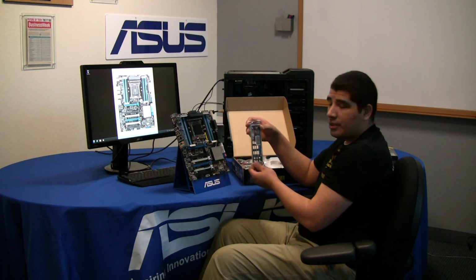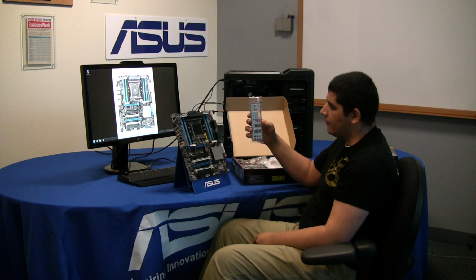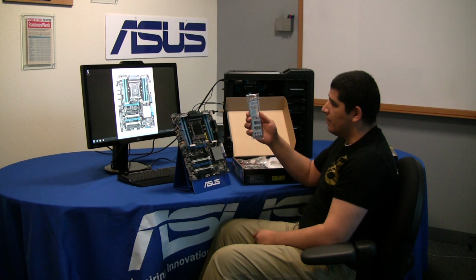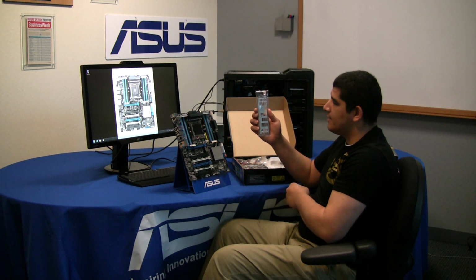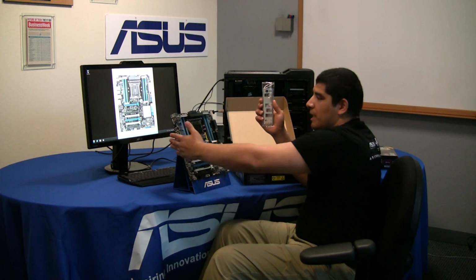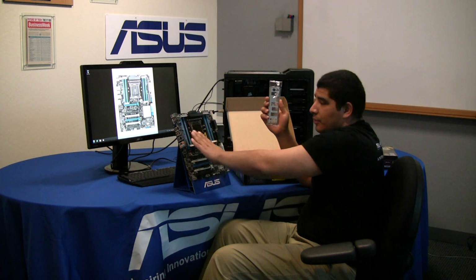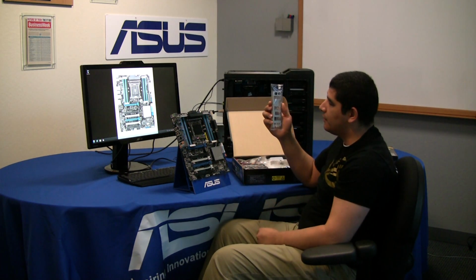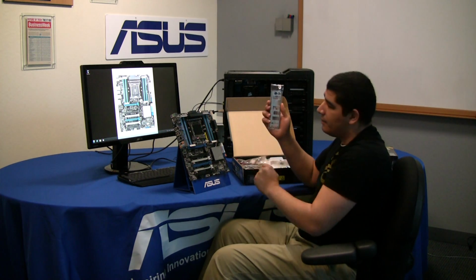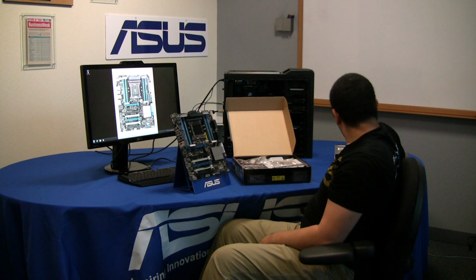We've got our Q shield. With our Q shield, like always, we have the soft padding to allow for a smoother, softer installation, but as well as this, Q shield offers enhanced protection against EMI, electromagnetic interference, because of course in our exposed backplane on our I/O, this area with more trace layout, not only for the 4 DIMM banks here, but also the I/O is more susceptible to different types of interference issues. So this helps to block interference from reaching this area, giving us better reliability, better stability.